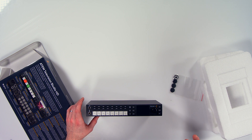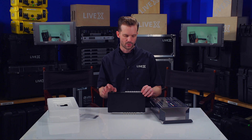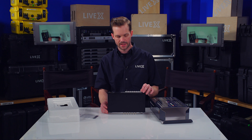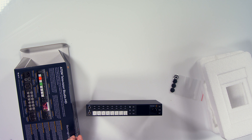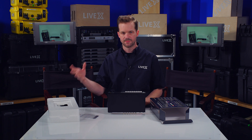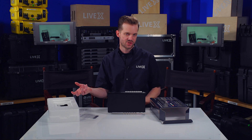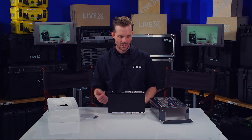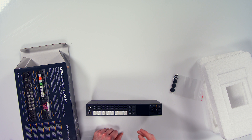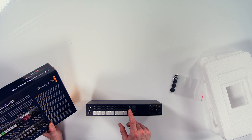The ON buttons on the top are actually audio controls. If you're bringing in audio on all your channels, you can leave all those on. For sources that don't have audio, or where you want a separate audio source — like a laptop playing back video or a playback machine — you'd want to set audio follows video for those inputs. For inputs that contain only scratch tracks or no audio, you can just turn those audio inputs off from the front panel. It's really helpful — you don't have to dig through menus if something pops up during your show.